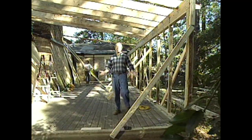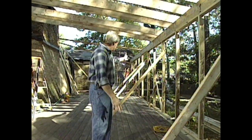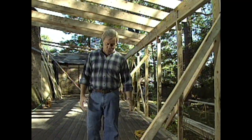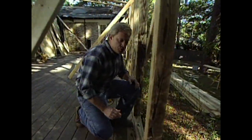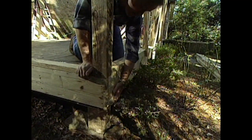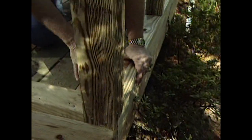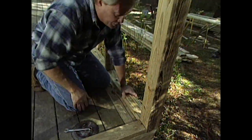The first step on this project was to remove all of the existing wood handrails. After that, we removed the existing stairs that we'll reposition in the center of this wall a little bit later. One of the first things we had to deal with was adding extra support on the outside of the existing deck to support our walls as well as our roof. We accomplished that using a 2x8 treated board wrapped around the existing framing, then extended the 2x6 treated boards out under where we're to build the new walls.